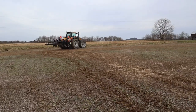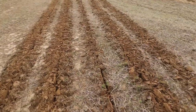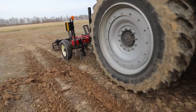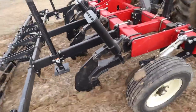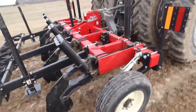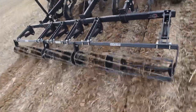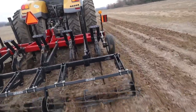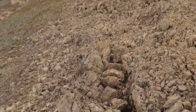Here's the Precious. Let's see what kind of job he's doing here with the zone builder. There's the compaction — you can see it moving the ground up right there. That's what we want. This will be good and soft. The good news is the zone builder with this basket really does get the clods down pretty good. Does a really good job there. Ground can be a little bit drier, but this is about as good as this is going to get. It definitely looks non-disruptive compared to the tile plow.